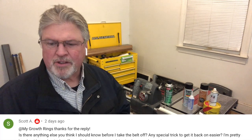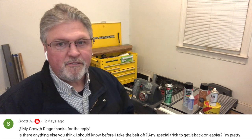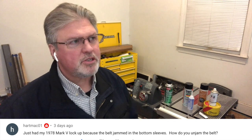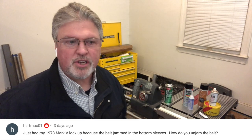Scott A. asked if there are any tricks for belt removal. I showed how to remove the V-belt, the poly-V, and the Gilmer belt — there are lots of tricks for that, but we're not covering that in this video. Someone also mentioned their V-belt had gotten caught up in the sheaves. That usually means it's done — you may as well cut the belt to get it all out of there. That happens when the belt is so worn things get real slack. Just cut it off, start over, and follow the instructions I showed for putting the belt back in place.